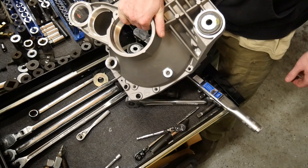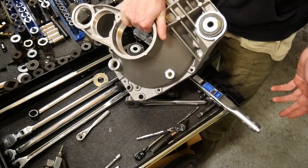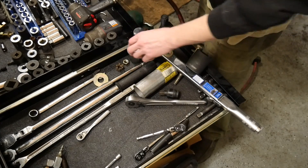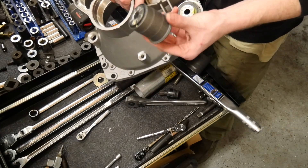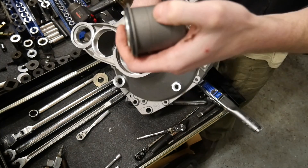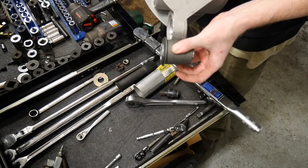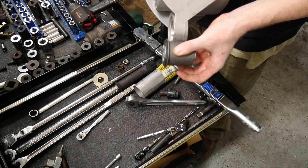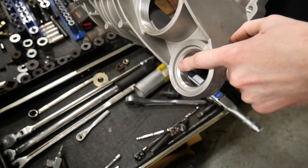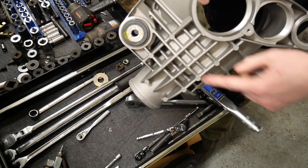Here's a quick tech tip for installing rubber-isolated, steel-encapsulated bushings — whether it's a differential bushing, subframe bushing, control arm bushing, or similar. This particular one has a small shoulder on the edge and will float between two positions, lining up in a mating flange. There's a 45-degree bevel on the bracket that forces it to stop when it reaches the seated position.